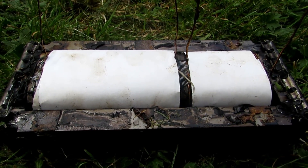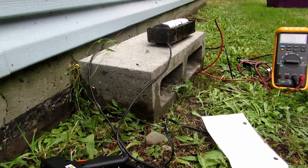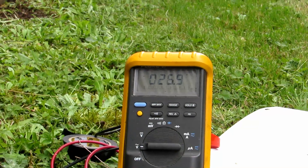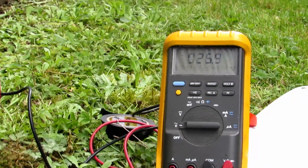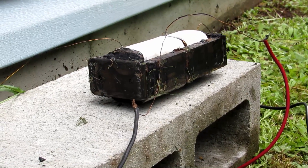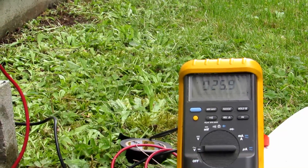I've hooked it up to the wall and it appears to be doing really well. I felt it a moment ago when the power was off and it's not warm at all after running for about 5 minutes. Zooming in on the voltmeter, you can see that we have about 26 volts - 25.9. This is excellent, it works really really well. If I needed to lower the voltage I could always rewind a new one using fewer turns on the secondary. Building a bridge rectifier is all you need to convert this to DC, and then you have a simple power supply for your homemade hydrogen generator. 25 volts is a bit high, so I'll test it out and if needed we can convert it down.